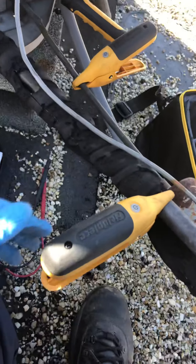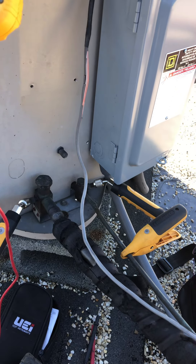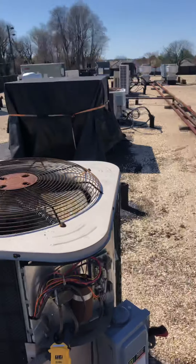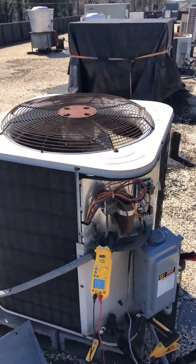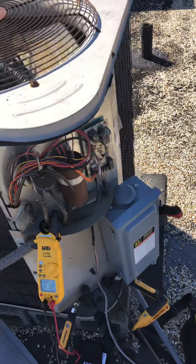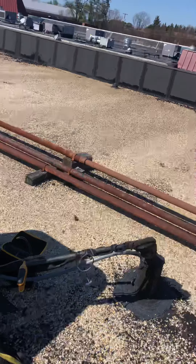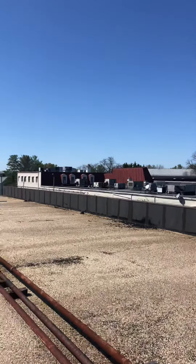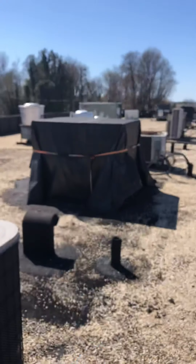It is low on charge — I'm only reading low PSI, and saturation is pretty low too. So I'm going to go ahead and take a look downstairs, see what the filters look like, see if they have been changed or not.